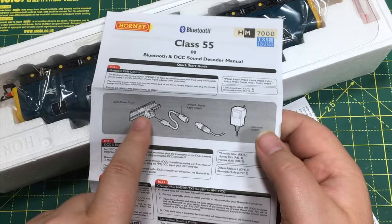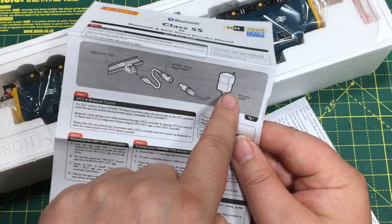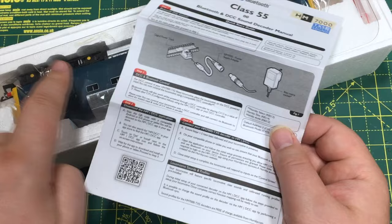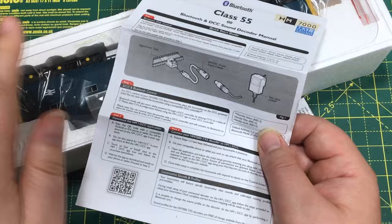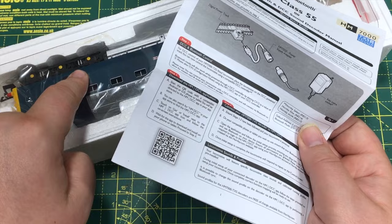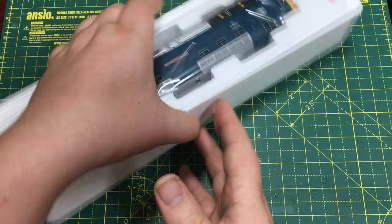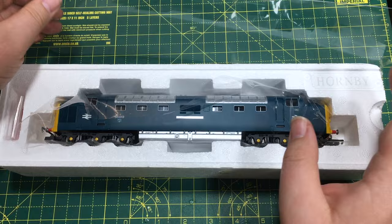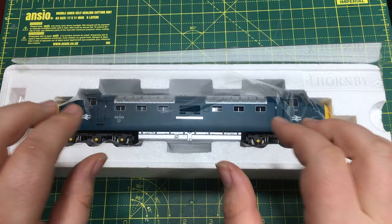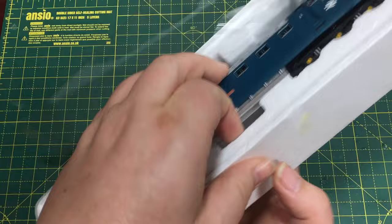Inside the box, we get some extra information to do with the TXS range. What's important is that yes, you can just put it on a DCC track and use that to power it. But Hornby also sell a range of wall plugs with adapters which allow you to energise the track and then control these with the Bluetooth app on your smartphone. It's important that you use something like this as it has overload protection — so if, for example, you have a derailment and a short, it's not going to pop the decoder. You can also use these as a regular DCC sound decoder, and out of the box these are by default set to work on DCC. You never need to actually use the software — it is just an already-loaded Class 55 sound file, and you can edit the CVs just as you would with any other DCC decoder.